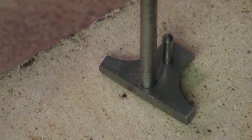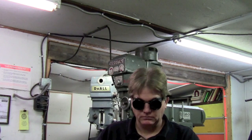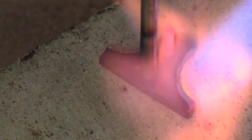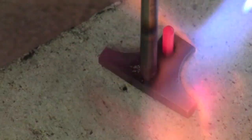After the tail and guide are positioned on the extractor plate, they are placed on fire brick and brought up to the silver solder operating temperature of 1700 degrees with an oxygen fuel torch.